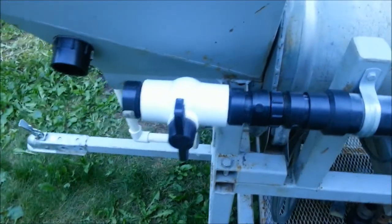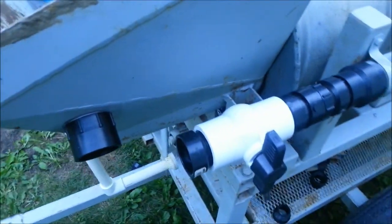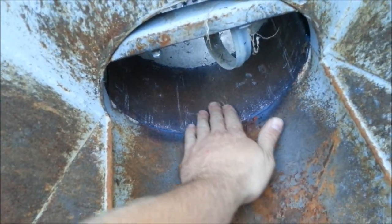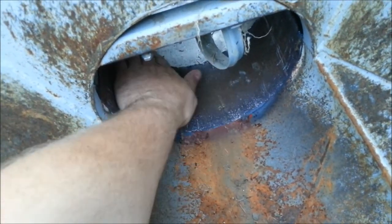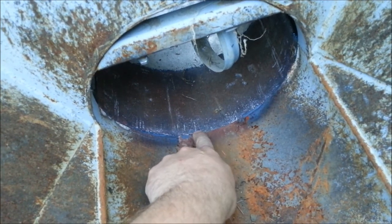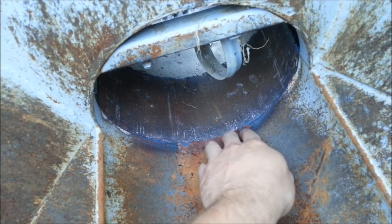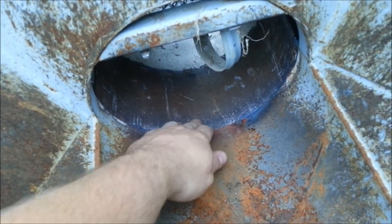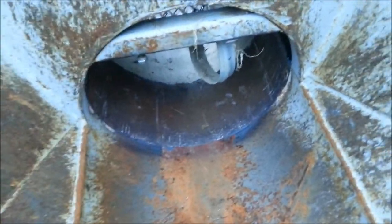I have a little different spray system up front — most of the water will come in up top here. Going inside, I also added this to extend more throat into the barrel of the trommel. It's just a half piece of metal welded on the other side, so that it extends into the barrel by another 5 inches to prevent water from splashing and rocks going underneath. Before I had them coming out here, but hopefully that's stopped that.